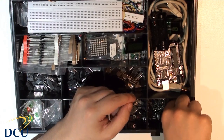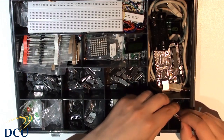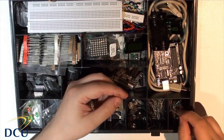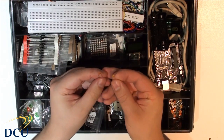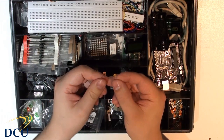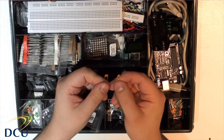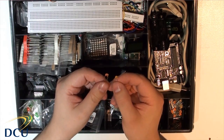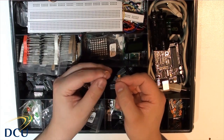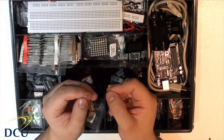There are also ceramic fuses — the fuse has squiggly lines. These are PTC temperature-controlled fuses: when the current goes above a certain level, they heat up and the fuse breaks, but when they cool down again you can use them again. They're a nice safety feature to add to a circuit.